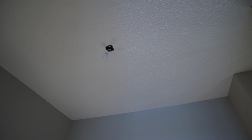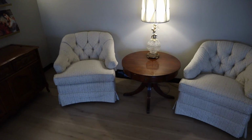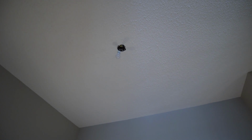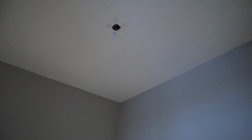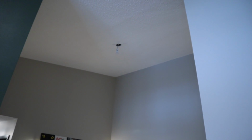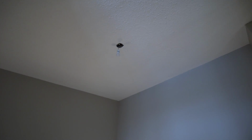This electrical box was previously further up the slope, which made a little more sense for something like a dining chandelier where you would want it a little bit more central to where a table would be placed. However, we had to go in and correct some shoddy electrical work, so at that point when we had it opened up anyways, I elected to move it down centered into this space, which just allowed me a little bit more flexibility with the size of the fan and really provided what I feel to be the best function. So this location is where I'm going to start today.